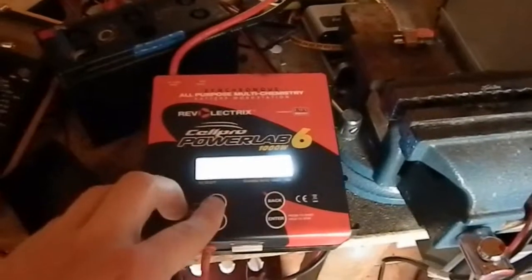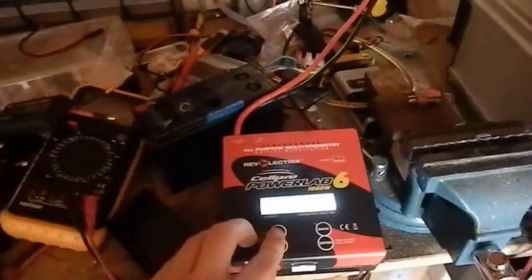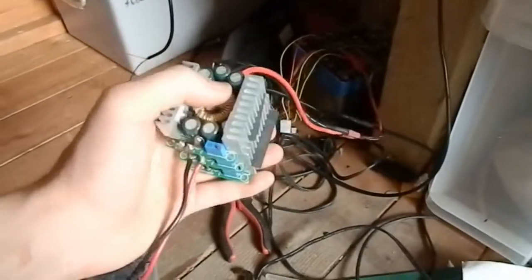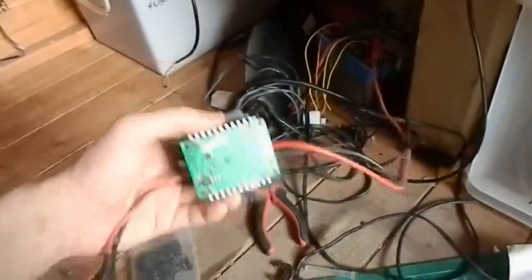They're sitting at 7.063 volts, so they'll need a little while. Then after that, I'll equalise them by connecting them up to a buck converter that I've got. 3 of them connected in parallel, which seems to have got broken when it fell. No, that's fine. I'll connect them up to this and equalise them.